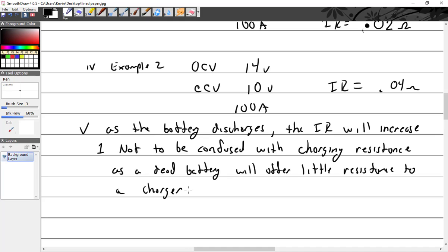So as the battery charges, the amps start falling off as it gets closer to its total voltage. That makes sense if you think about it. It's filling up with electrons and so the current starts to die off. But if you try to make that make sense with the internal resistance comment, the two don't match. They're not congruent. But they're completely different things. That's what I'm saying.